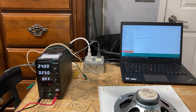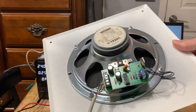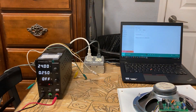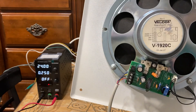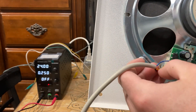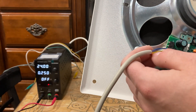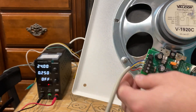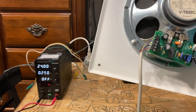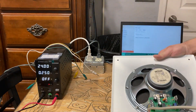For my power supply I'm using this bench power supply set at 24 volts at 250 milliamps. It will also run on 12 volts but it'll be more on the distorted side. I've pre-wired this: the blue wire is my tip, yellow is my ring, the black wire is my negative 24 volts, and the red wire is labeled GND — but that is actually positive 24 volts. Valcom made it a little weird, but that's the way they did it.